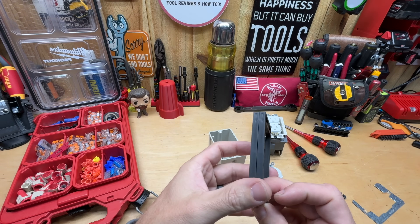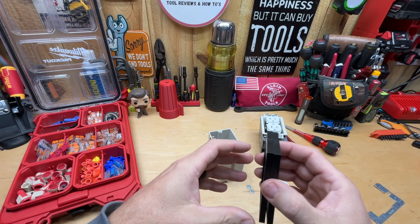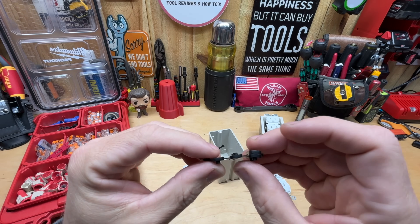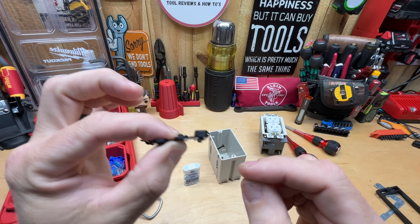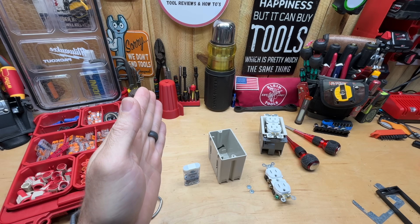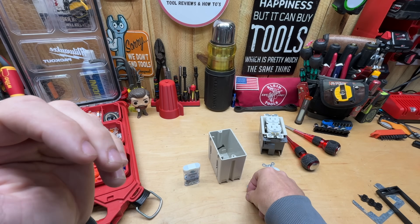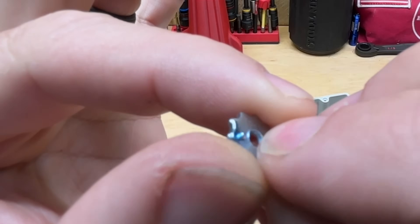The other thing I really like is the fine-tuning of the adjustment. With box spacers, if you've got a three-eighths gap, you need multiple sizes, and you might still not hit it exactly. With the plastic spacers, there can be a point where you're shimmed out just a little too far or still a little too sunk. That's what I love about the UniShim — you can dial it in precisely.